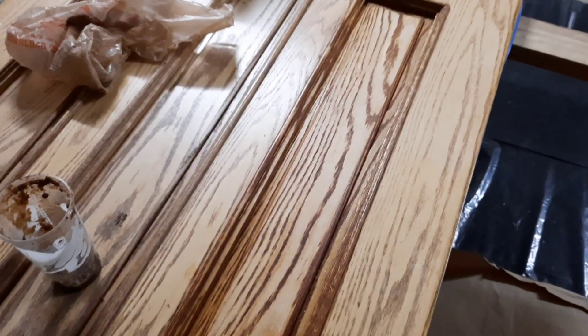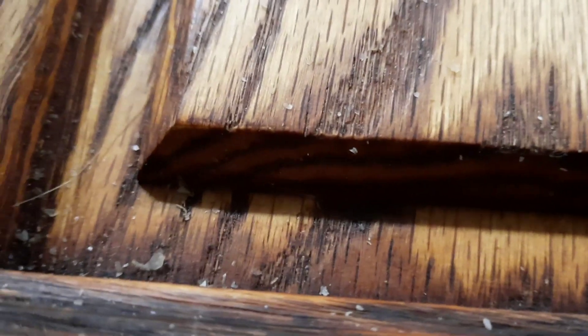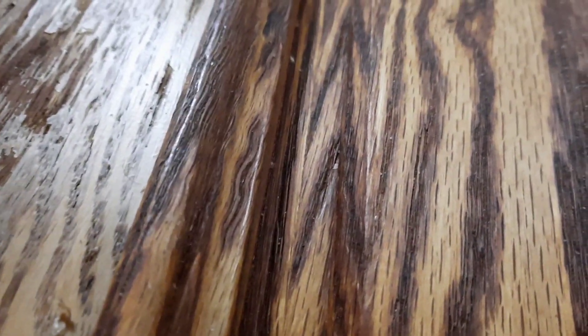I'm going to work on this panel again later. I worry about getting it too wet — this looks pretty dark in here and I don't want to lift up any of the wood grain. I think this could be some sun damage that will have to be sanded out, or it could just be a little wetter than we wanted. Overall it's coming off, but looking at the facets on this molding it's quite a job to get in all the grooves.